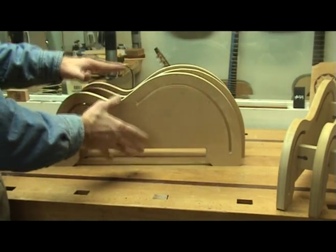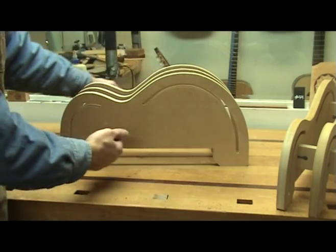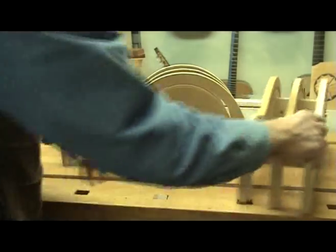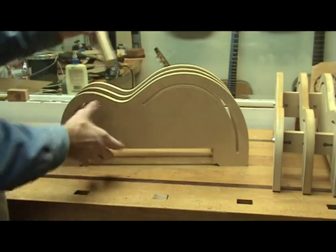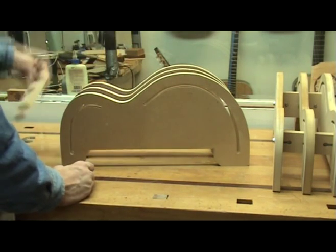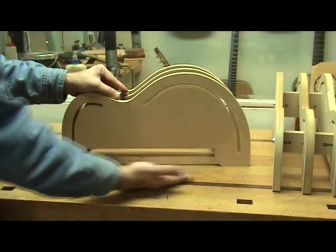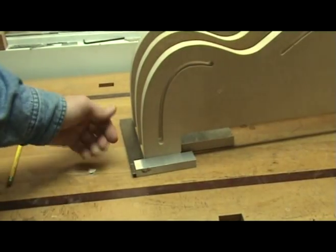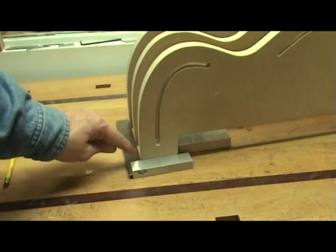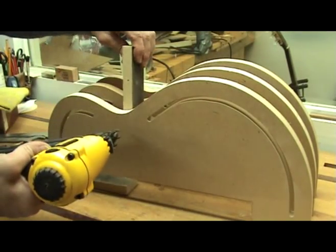Here are the three pieces I just cut out. I now have to put them together, and there are several ways to do that. You can put a bolt through it and pull it up tight, but you need to put some spacer blocks in there. I've made some spacer blocks that are 1-7/8 inch wide — the same width as what comes with my bender. I'll put them in like that, put a nail in to hold it, then come in and screw it. The important thing is that everything is completely aligned. Use a square to align the front, and use the bench as a point of reference so they're all flush across the top and across the front. I'll start by putting one spacer block right here in the middle.